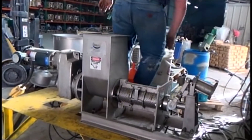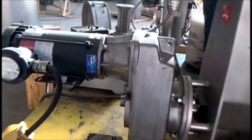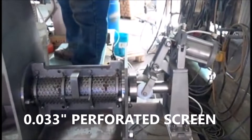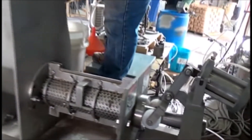We're going to run this in a CP4 press, a one-and-a-half horsepower motor. You can see the screw. And the screen I'm using is a perforated screen with very small holes. Got the discharge cone closed, going 20 RPM.